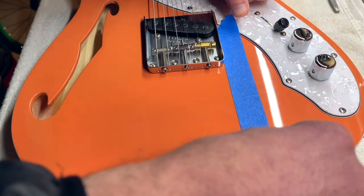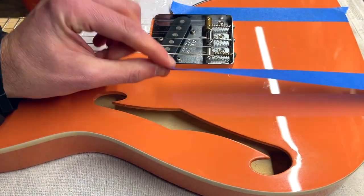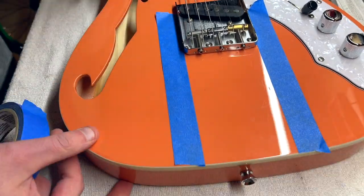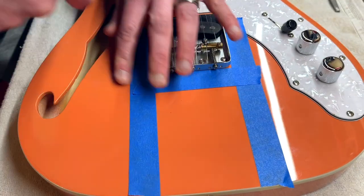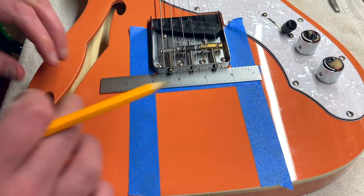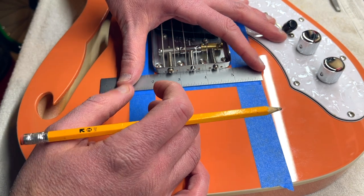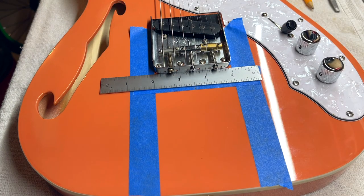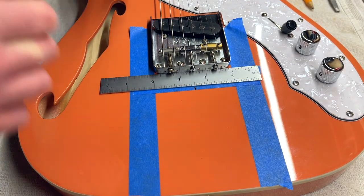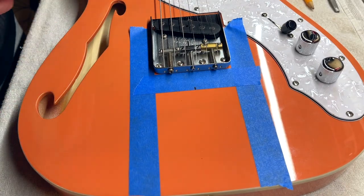The first thing I did was take some blue painter's tape and place it along the sides of the ashtray bridge. I also put a strip of tape along the bottom of the bridge to give me an idea of the centerline of the ashtray, the neck, and the body of the guitar. The ashtray bridge is about three inches across, which puts it at an inch and a half from either side. I put a pencil mark there first but it didn't really show up, so I used a Sharpie. All of this tape probably isn't exactly necessary, but I did it as extra assurance of the alignment.